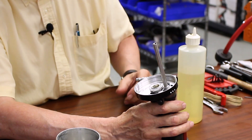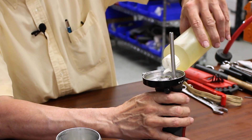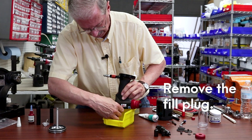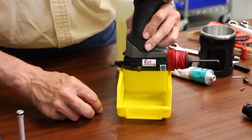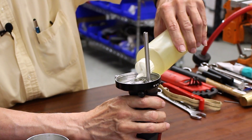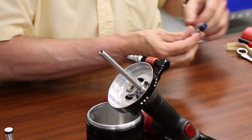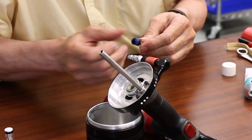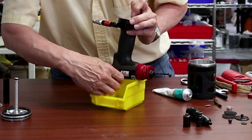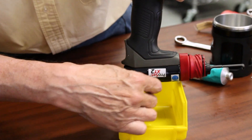We can move on to recharge — we'll put the hydraulic oil in and go through that process. I'm going to remove the plug so you can actually see the oil coming out. You can see it's starting to drip out, so I know I have oil in there. We'll put the fill plug back in and refill this. We want to insert our RAM seal, making sure we've lubricated the O-rings. We have a little container for excess oil, and we'll insert that. We'll open the bleed port enough so we can see a solid stream of oil, then close that.